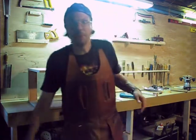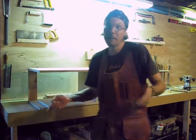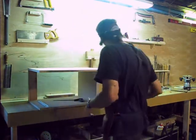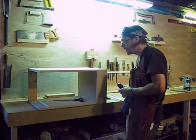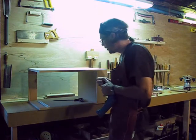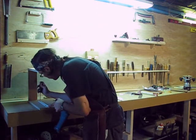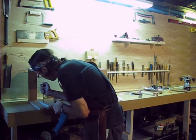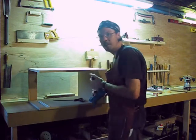Looks haphazard, but when I was building 6 kitchens a day for the mobile home industry, this is about how I did it. And I had a lot of complaints about other stuff, but never about my drawer guides. So I think this is pretty adequate. So it's just like that. Put 2 or 3 screws in each, and you're good to go to move on.